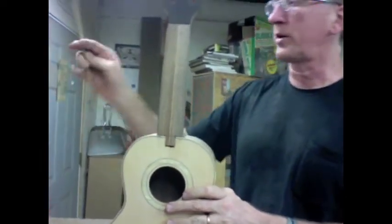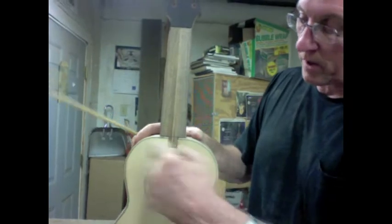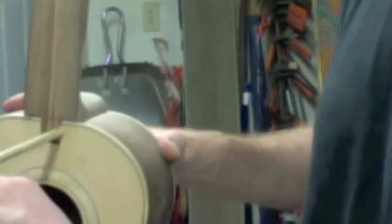What we're going to do is drill a hole that goes halfway through the mortise and halfway through the tenon. A chunk of this oak dowel rod is going to be cut off and glued into that hole.